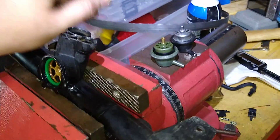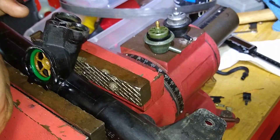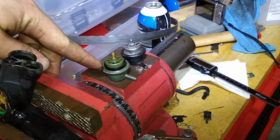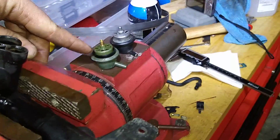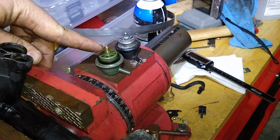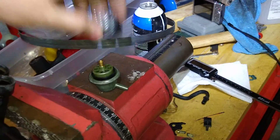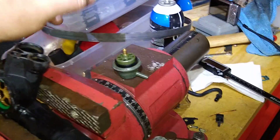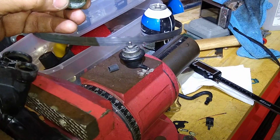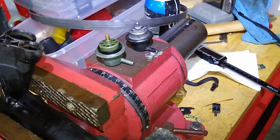With this China regulator fully ported, I can drop my fuel pressure down to 43 psi if I just completely back off the reg. Whereas before — stock China regulator — I couldn't get it below 90 psi. Then I bored it out the best I could with the drill bit but never finished it off using the rotary bit, and I only dropped down to about 62 or 63, which is where the stock regulator was at. I couldn't get this below 63 even with vacuum applied — it should have been at 50 psi with 50 kPa of vacuum on the diaphragm. But once I finished it off with the diamond bit, I can drop it down to 43.